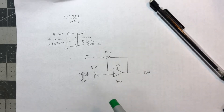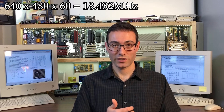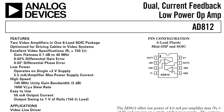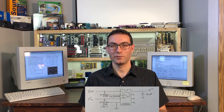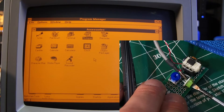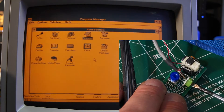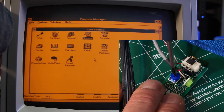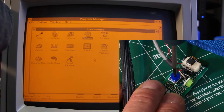It will involve the use of an op-amp. I started with a simple circuit, but the part I chose was not enough with its 1 MHz bandwidth — good for audio, but far too limited for a video signal. With a resolution of 640x480 at 60 Hz, we need at least 18.43 MHz bandwidth. The only part I found in my stash is this surface mount video op-amp. I made a very simple but effective circuit. The decoupling capacitor is required to filter the noise. The 1K input attenuation potentiometer drives the overall brightness. The second 1.8K potentiometer changes the feedback value and acts almost like a gamma adjustment.